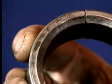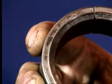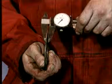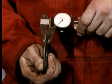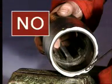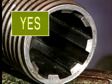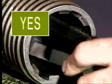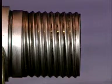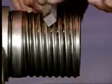Then check the top and bottom surfaces of the bit retaining ring assembly. There again, emery stone or cloth will restore the surfaces, or the assembly should be replaced if it's damaged or badly worn. Check the thickness of the chuck spacer ring against the wear limit details in the manual. Inspect the chuck reaction seat for damage, usually caused by insufficient or excessive feed force. Inspect the chuck splines for wear and clean up with emery stone. Replace the chuck if the splines are badly worn. Inspect the chuck threads for wear or cracks and clean up using emery stone.